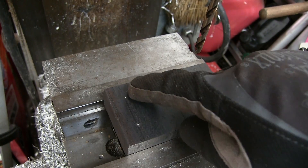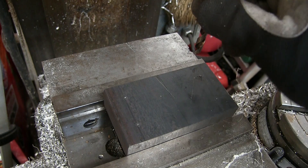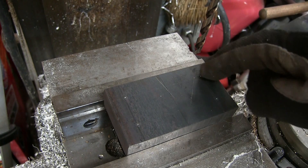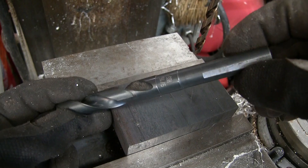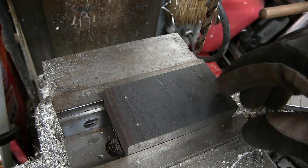We've got our basal platen all marked out. This will be our upper basal platen. We're going to through-drill it with a quarter inch in the milling machine on warp eight, and then come through with a nine-sixteenths of an inch - nice and big - for some loosey-goosey fudge factor to let this move around a little bit.